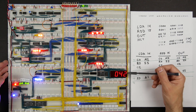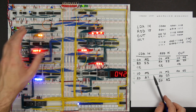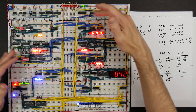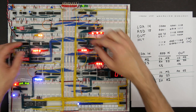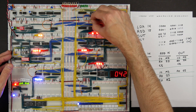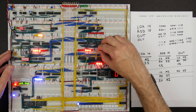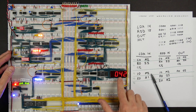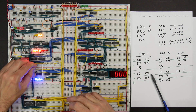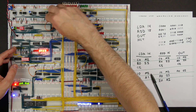The question is, what happens if I want to run this program again? To run the program again, we've got to reset the computer, which right now is kind of cumbersome. We have to stop the clock and then reset each module individually — each module has a reset signal hooked up to it. For example, the program counter reset signal is here, and if I take it low, that resets the program counter to zero. With the A register, if we take it high, that resets it. Same with the B register. The output register resets if we take it low.